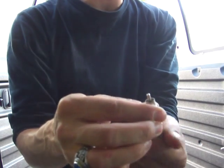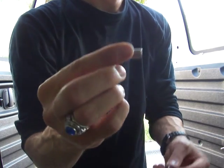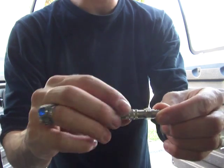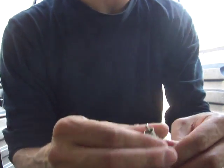If you want to connect two cables together — say you didn't make it long enough — you need a coupler. Also, this is how you make it into a video cable for video surveillance: the coax turns onto the RCA adapter, and then you plug it in — that would be your white RCA video. There are also couplers where you can extend and join two cables together. Thanks for watching.